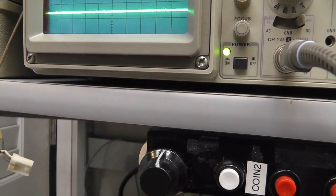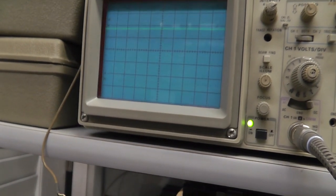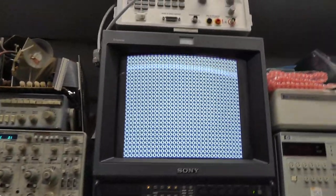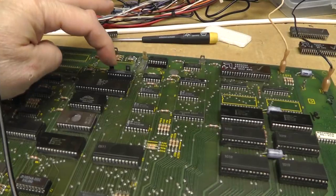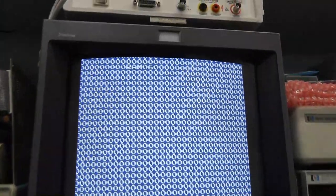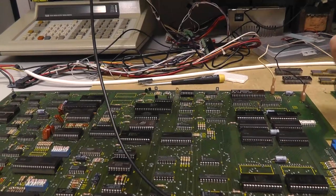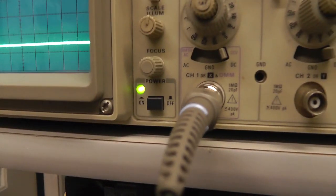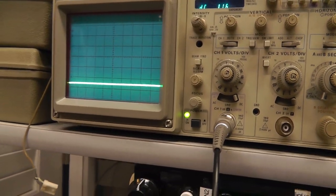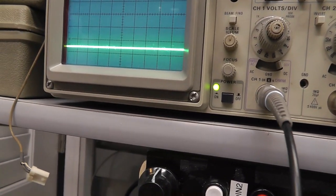This might have gotten even worse — the power is totally jacked up now. The signatures we were getting earlier explain why it's probably not even doing anything. Let me try reseating it. After reseating the same 7C PAL, there's our RAM 6 error and it's resetting. Checking the reset pin — yes, it's resetting, but pin 12 has activity. Maybe that's why we were getting signatures on it.